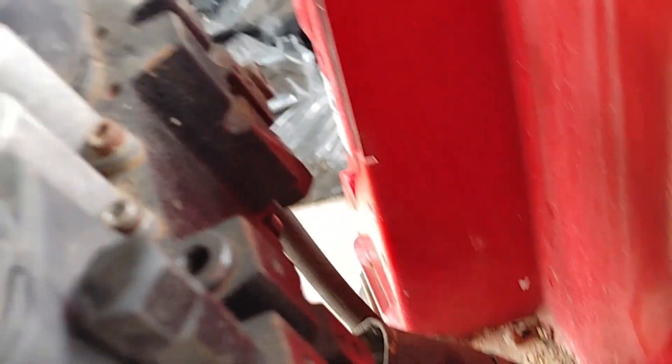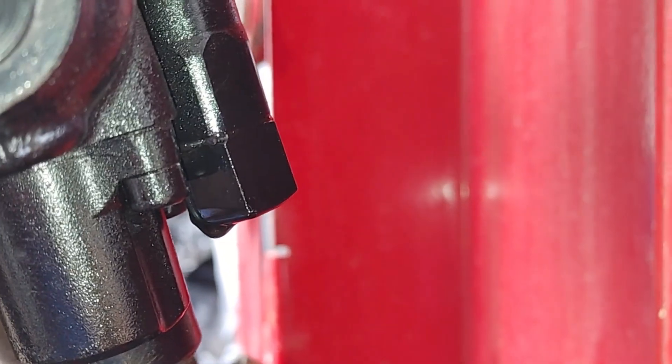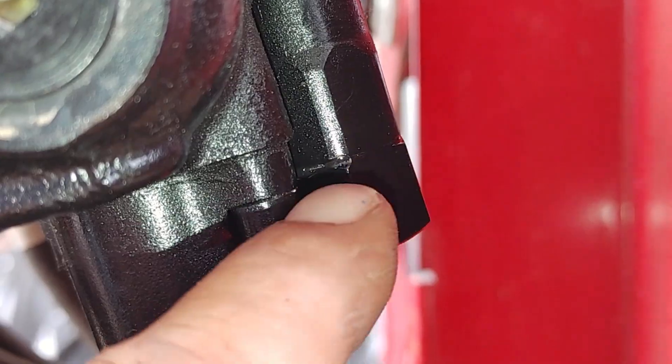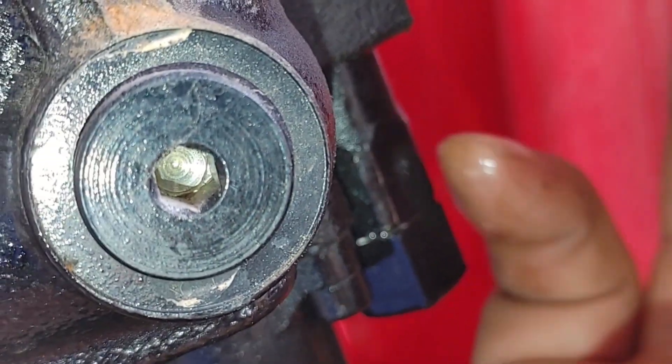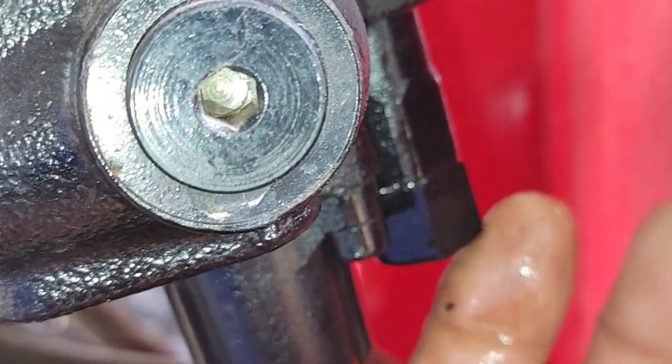You've got one bolt here and two on that side. What I found was when I leaned it out, as you can see it dripping right there, it was leaking from right here. If I can get the light to focus in — that's where it's leaking. And what it is, is right there at that seam, and if I can get in just right, you can see that there is a gasket bulging — a little O-ring. That O-ring is bulging. Both of these suckers are hex-headed, so I can put a wrench on the stem as a backup and hold it. I think all this is, is just a cap on that sucker — it's got an O-ring, because there's a spring in there, and this cap holds the tension on that spring.